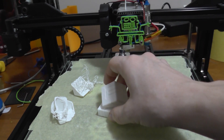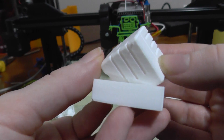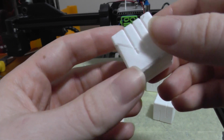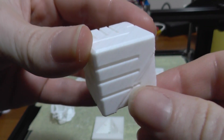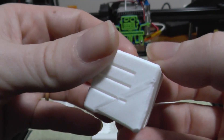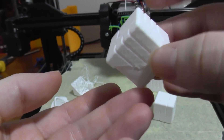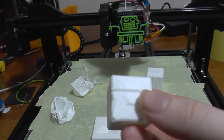Next up, the one that I printed with the supports. From the top, everything looks fairly good — not very good, actually. All the faces are nice. Unfortunately, some sort of thermal expansion magic was going on down here. The part of the print that was surrounded by the supports is a lot — I'm hesitant to say thinner — it's indented when compared to the outer edge of the other parts of the print. That's where it was connected on the bottom, and the support stopped it from wobbling so much that it would disconnect. So as you might have guessed, printing on the corner is probably not the best idea.